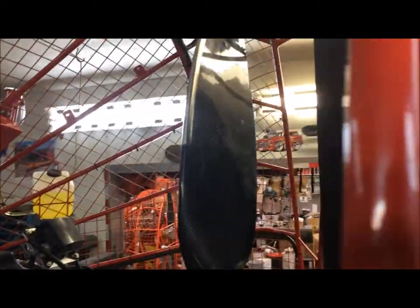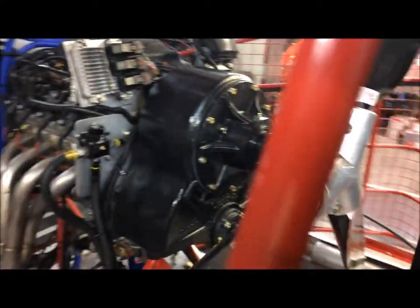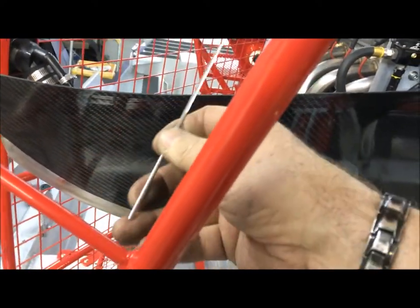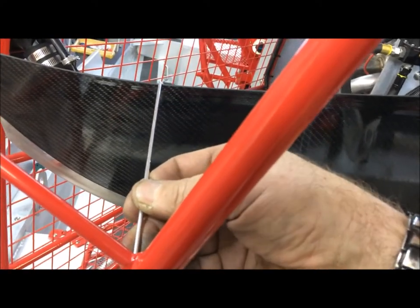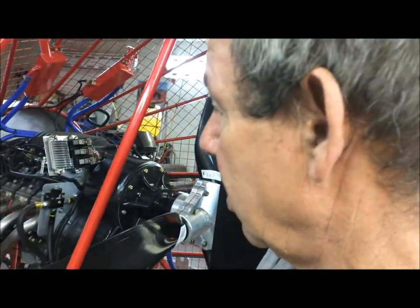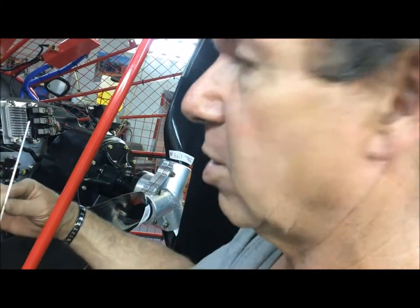We're setting this blade — we just put the three paddles into the main hub and we're setting the distance we know to be true using a piece of aluminum fill rod. We put it here and know that this blade is real close, so we set all three blades to the same position — exactly the same — so there'll be no vibration. Once you know your max RPM, just index them with a feeler gauge and set your blades that way.